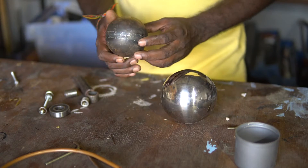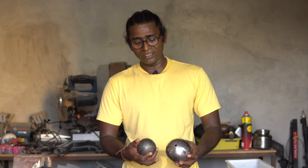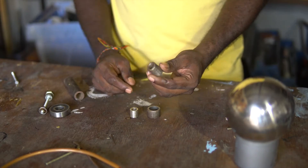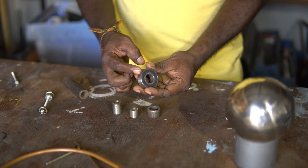For the next version of our project — the steam turbine or the Aeolipile — we'll need a metal ball like this. You can also get one in steel, but welding on steel is a little tricky, and when you heat it, it can warp, so why not get the easier one — it's a lot cheaper. You'll also need a bush. I found a few in my workshop, salvaged from an old motor. In case you don't have a bush, you can make one from an old iron pipe, or utilize the inner diameter of a ball bearing — just cut the outer race off and weld a couple of pieces together.